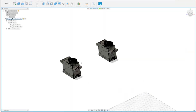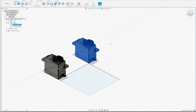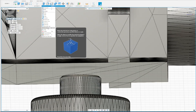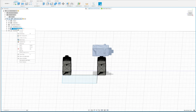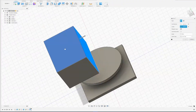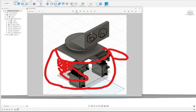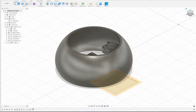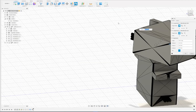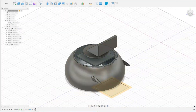For CAD, I'm using Autodesk Fusion 360. I start by importing servo models — they are in mesh files, so it was kind of hard to convert them to object files. I need object files so I can rotate the servos easily. I kept CADing, placed some servos, and decided to move on. I'm CADing the head right here — it's just simple geometry. By the way, round-shaped robots are just so cute and approachable, don't you think? Finally, I went back to fix the joint states so I can rotate my servo correctly. Once that's done, I put the arms on and had it wiggle to make sure they fit in the body.